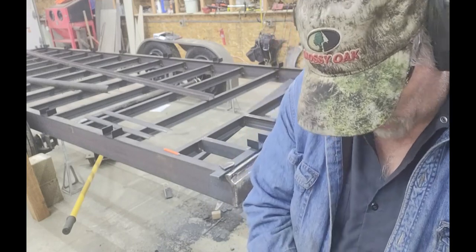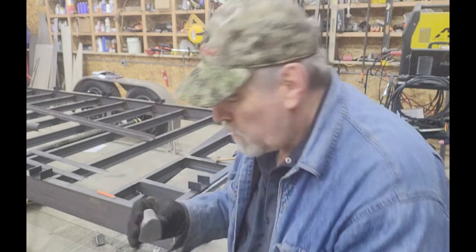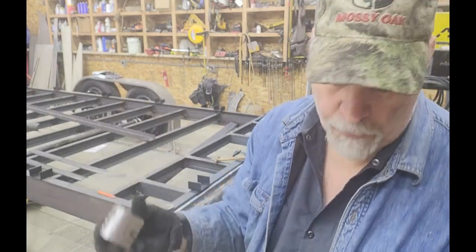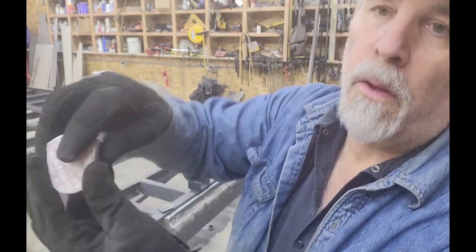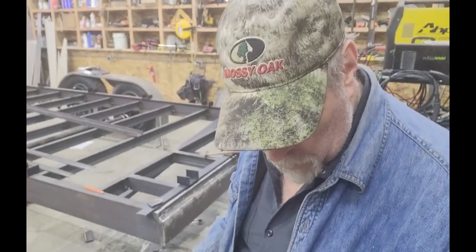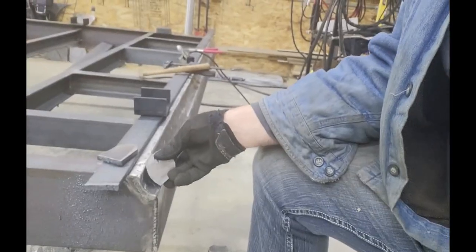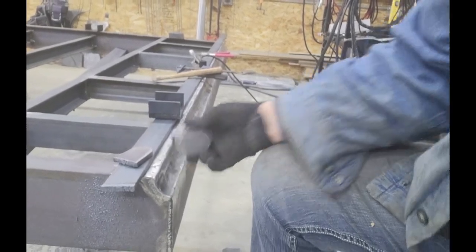I finished dressing that up on the belt grinder. What you end up with is a block of all five hinge ears, and when you lay the template up on there it matches exactly. In turn, they will fit right down into that channel. It doesn't look like it lines up now because of the weld beads holding the stack together, but once those beads are out it fits in that curvature nicely.